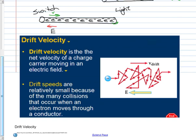That's what it really is. So I multiplied it by 60 and we'll get, I think it's about a meter per minute. I have to do the math again. So that's pretty slow. If this is 5 meters from the switch over to there, no, it's about a meter per hour, not a minute. It'd take about 5 hours for an electron to make it from where that switch is to where the light bulb over there is.